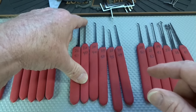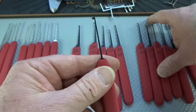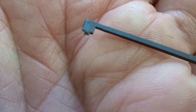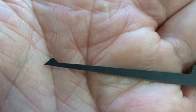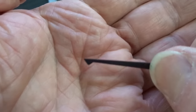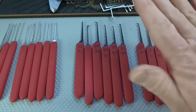Over here we have another identical flag — the shaft is the same all the way down, but the thickness goes from 47 to 26 thousandths. These two are almost identical; the only difference is one has some kind of manufacturing artifact on the tip — I think that's a manufacturing defect rather than intentional. The half diamond is not a bad shape, everything is sharp, going from 51 down to 22 thousandths. In the middle it measures 37 thousandths, so you won't get this into most American or European keyways past the midpoint.